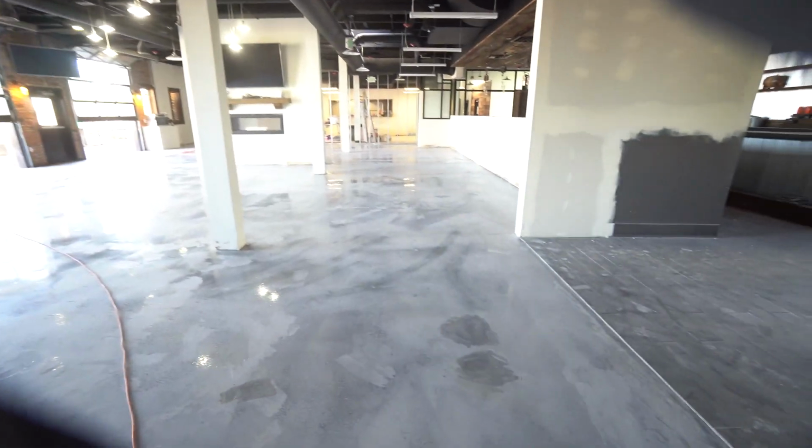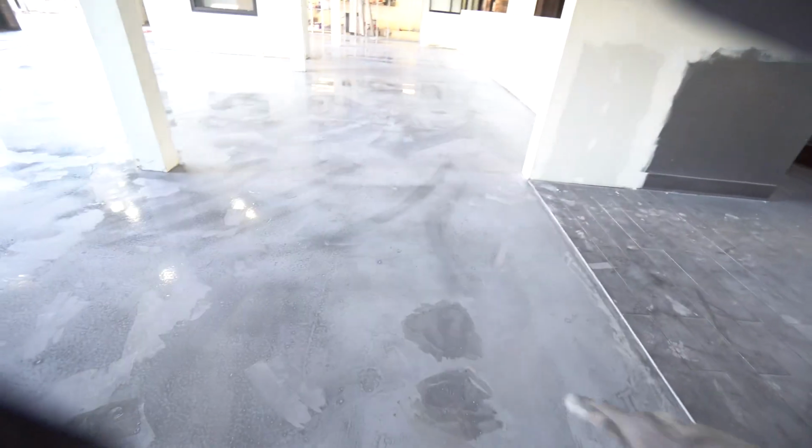So we're doing a really dark base. So we're doing like an aluminum, onyx, snowflake, suntan. So there's some dark colors in there except for snowflake. That'll cover all this. So we won't have to really worry about the color variations so much. But when you're dealing with a light floor, it's really important to pay attention because you can't have a patch like those in the middle of a light floor because you'll see through that.